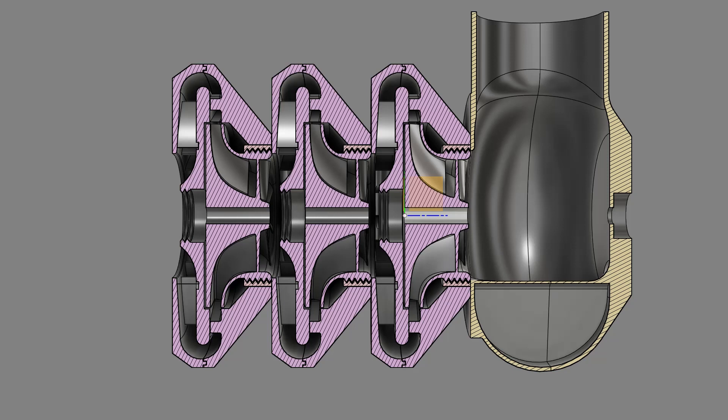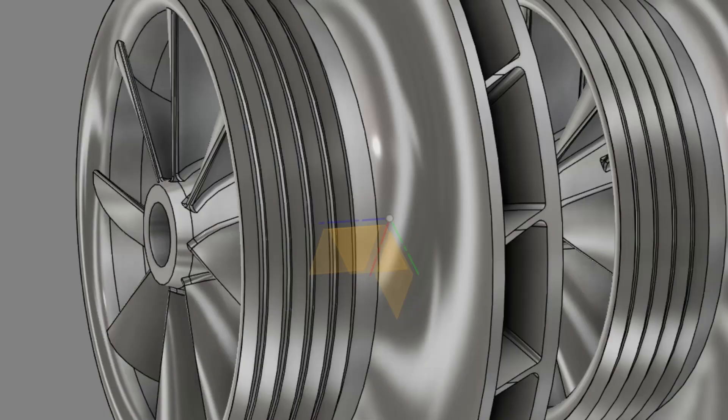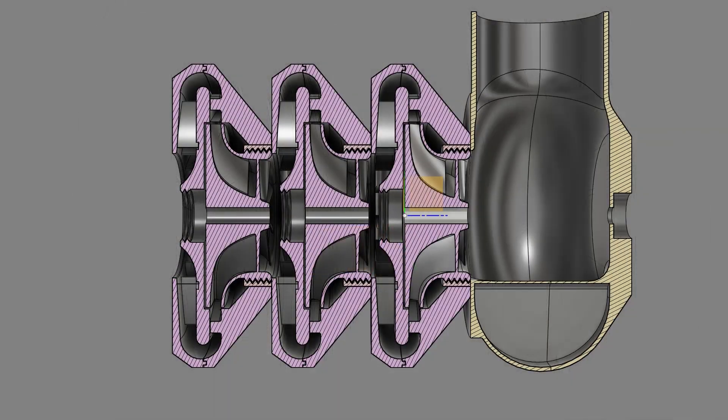I initially designed an axial multi-stage centrifugal compressor — this is the same compressor wheel but with a shroud added. The shroud increases the efficiency a little bit, reduces the volume output, and also allows you to add labyrinth seals so you can actually seal the compressor wheels between the stages. But when I looked at printing this, it was several kilos of plastic because of the housing, the volutes for the intake and exhaust, and all the necessary support material.